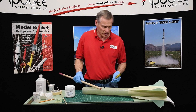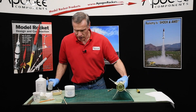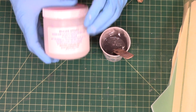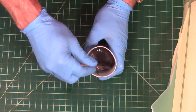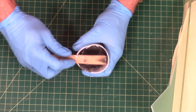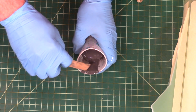Pull out the tape — that one's on there. I'm using Aeropoxy, or Rocket Poxy from Glenmark. It's a two-part system, and it has a black dye so you know you have it all mixed properly. If it looks any marbled color, that means it's not fully mixed. A little bit like right there is very good.